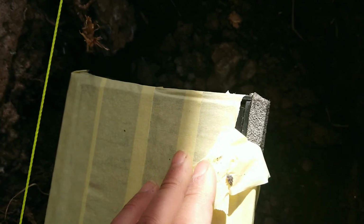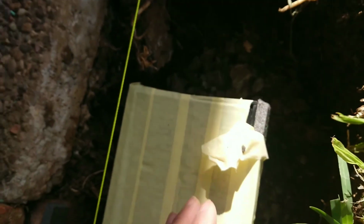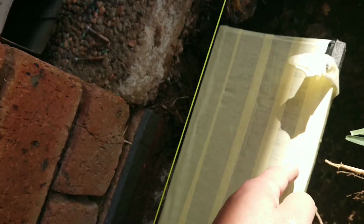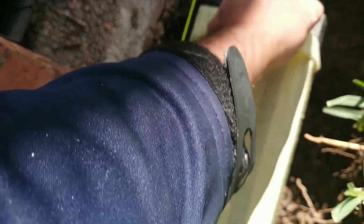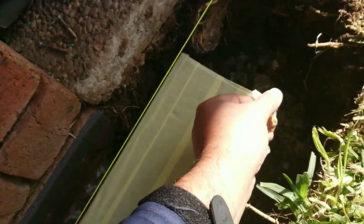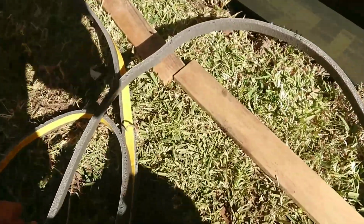And on the edges, I use the compressible material. It's a 10 mil as per the instructions by the manufacturer. The reason we use these ones is because when you try to open the grates, if you wanted to clean for maintenance, it's a matter of sticking the screwdriver in these little holes provided, and it will compress this one here, it will open. Without this, you're gonna have a big problem to open them. It will not open. So the compressible material you buy, that's this one here.